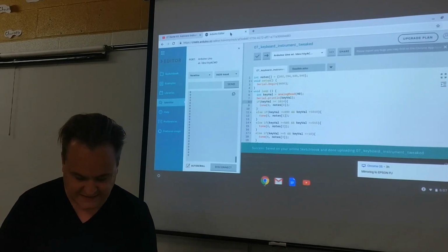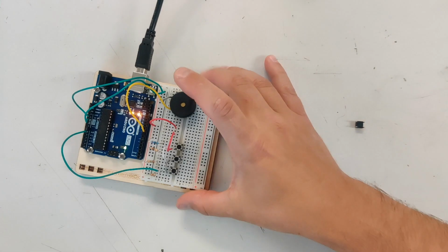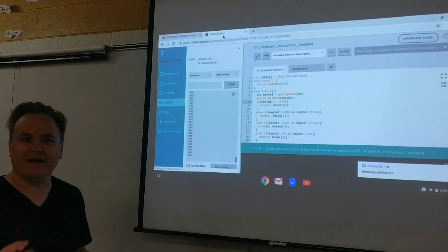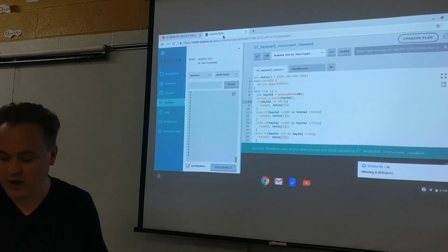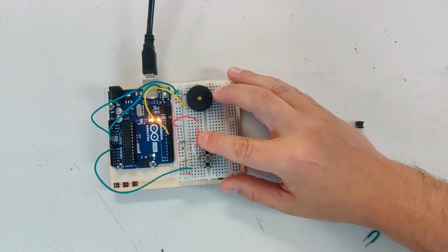If you look, the next button says anything from 990, right? Anything over 990. And if I push the next button, 996. So I only have between 996 and 1014 of a margin of error. So I have to be very careful with my code. But I can always read and see what each button is doing, which is really cool.